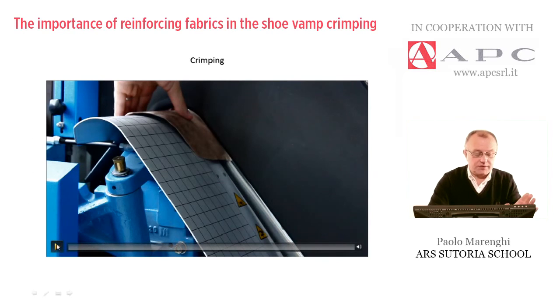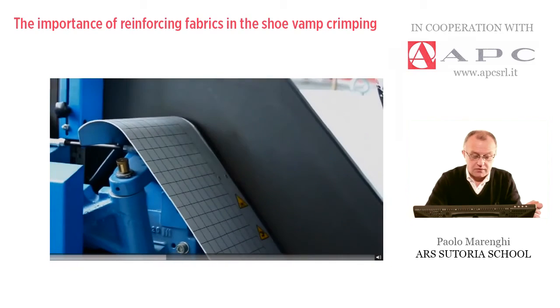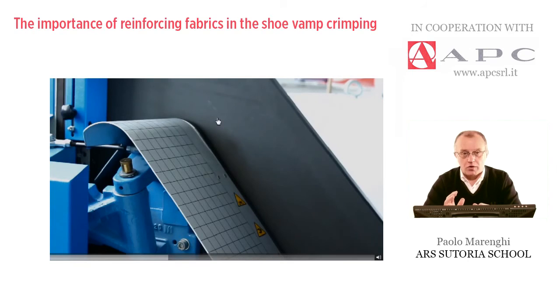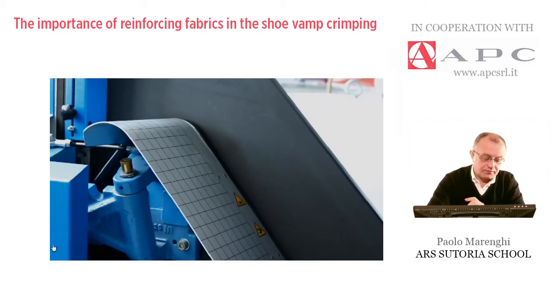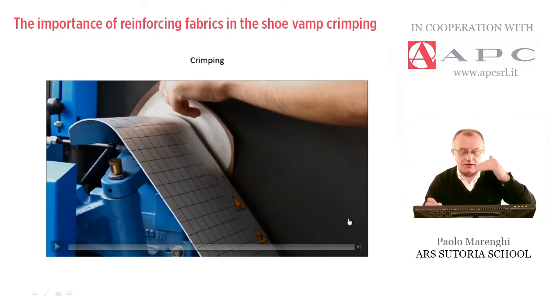The crimping operation is very slow. The operator is pressing the pedal step by step and pulling the sides of the machine. The mold is pushing — this machine is made by three plates. The two side plates are a little colder and they pull the piece to be crimped, while the black mold giving the curve is warmer — hot — and we push the piece into the opening. After a few seconds — the timing depends on the material — the machine will open and the piece is perfectly shaped and molded.